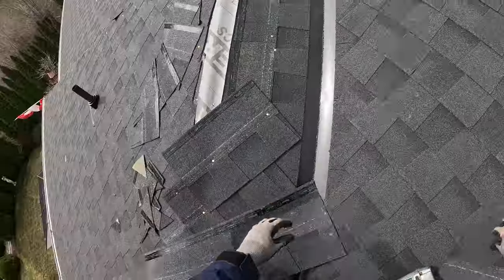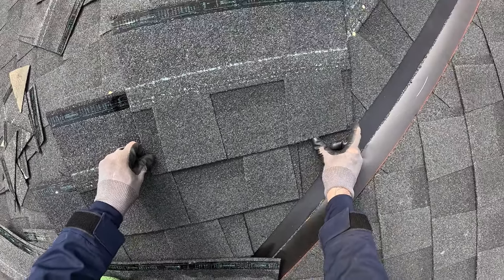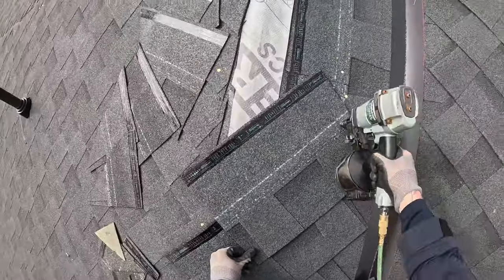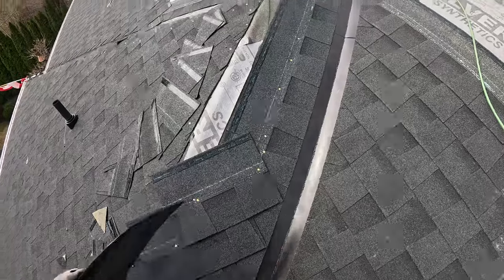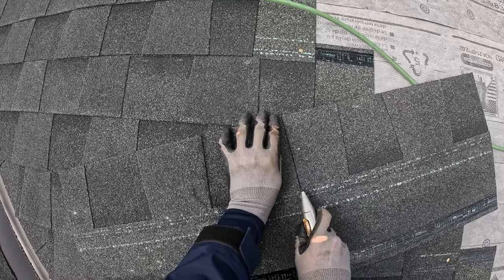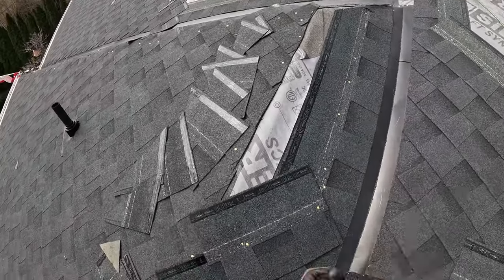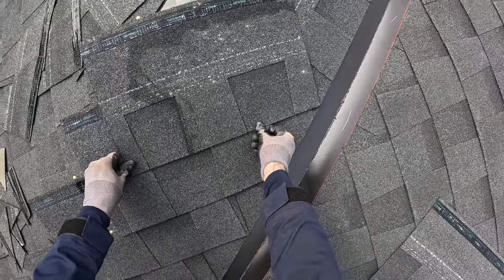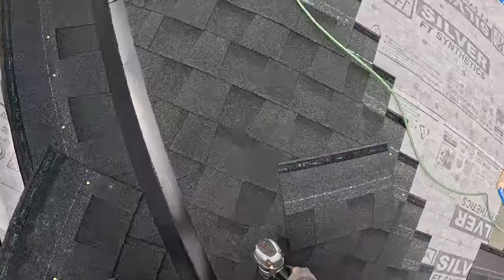It should cut pretty good now so I might not have to keep doing that extra nail. Look good — that's what I'm looking for. If you get a rollover or a little blow-through like that, just put another nail in — don't be lazy. When I was talking about caulking low nails — I rip the shingle off and replace it. If I low-nail I don't waste my time going around caulking things after. It takes me five seconds to replace a shingle versus 10 minutes of going around trying to find all my mistakes instead of just doing it right the first time.